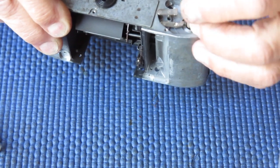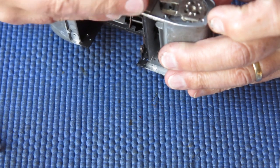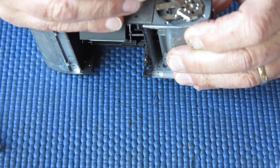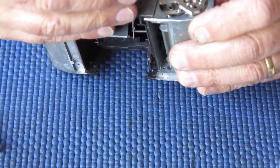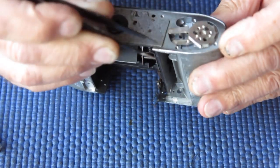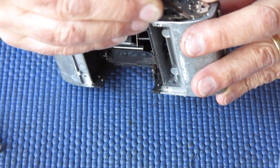And I know from experience where I want to start this so that I'll have correct tension. If it was a rangefinder model, I would be starting it right there in its rest position, and it would be wound one full turn and then the film advance lever would go on. With the reflex cameras, because they've got a lot of extra drag with the cam across the camera and so forth, they need a little bit of extra oomph for that return spring, so I normally advance them by one third of a turn.